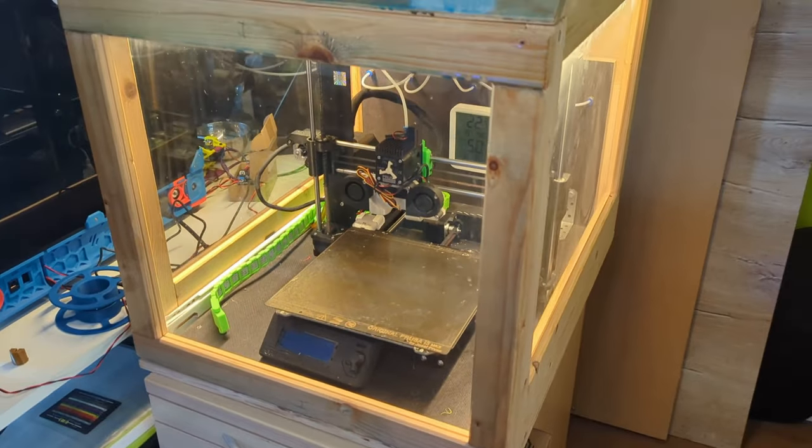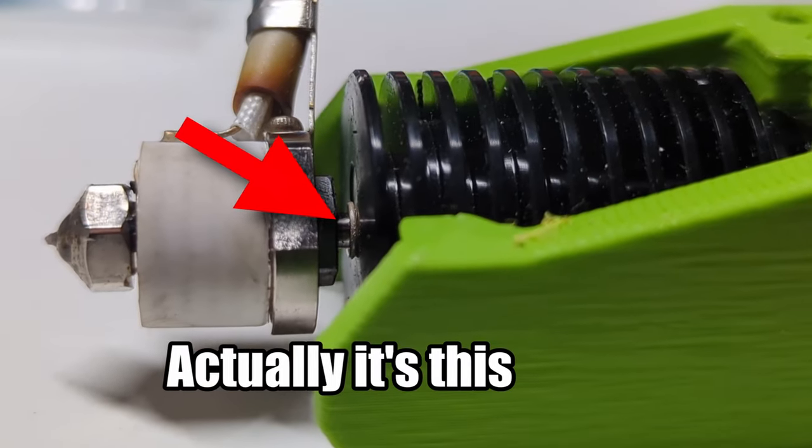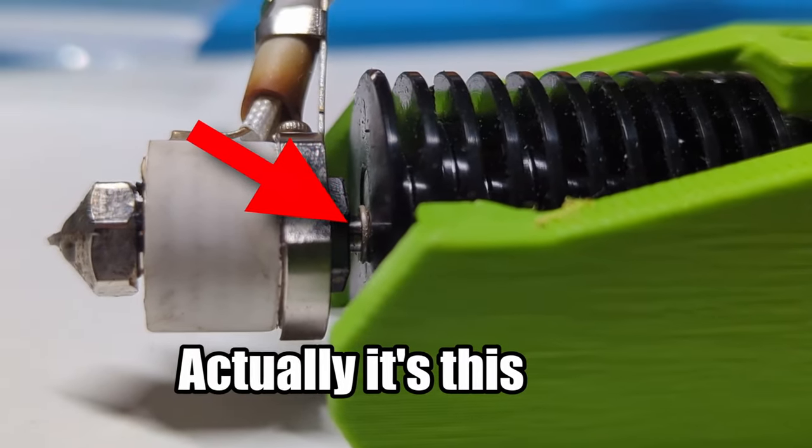You can also build a custom case out of wood or aluminium profiles. Today I'm still using a custom wooden enclosure for my Prusa Mk3S with great success. The only thing absolutely crucial is to place the power supply outside the enclosure to avoid overheating in the long run — for occasional use with a cardboard box you can get away with keeping it attached. With my enclosure I've experienced issues when printing PLA: the internal temperature gets to around 40°C, making the material get soft too soon and causing heat creep — where it gets stuck inside the heatbreak mid-print. The easy fix is to just leave the door open when printing PLA.